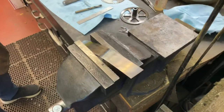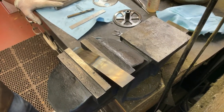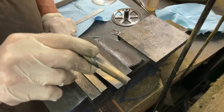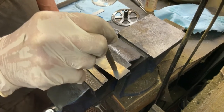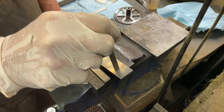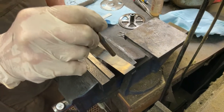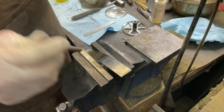So you're making the hard metal soft? I made the hard metal soft. Now what I'll do is let this cool down, and then I'll round the end off — you can use a file. And then I'm going to center punch the hole where it is. I'll have it all drawn out and show you how I do this on the drill press. You can do this at home if you clamp it onto a two-by-four and drill it. This is a lot of fun, and that's my tip for the day.